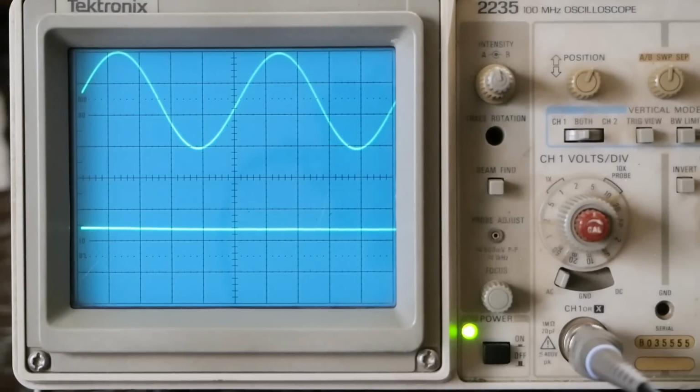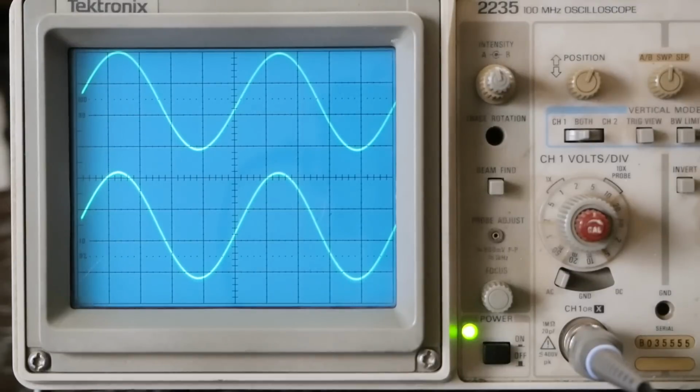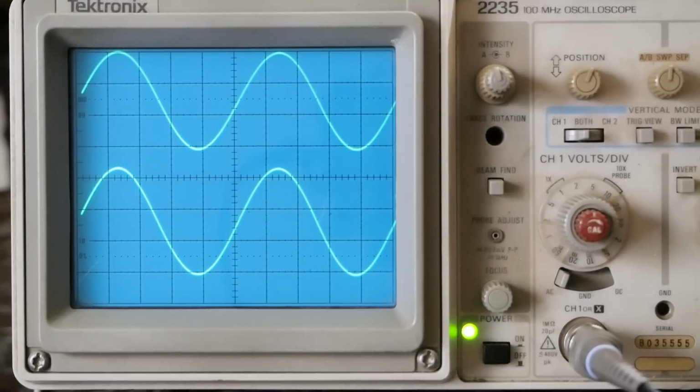So first I want to just see what this sine wave looks like, and this is interesting. There's a little over 3/4 volume, and that's basically unity gain, which honestly, for how most people would use this preamp, that's a good thing. From what I've seen, most people are wanting to use a preamp on solid state gear that probably doesn't really need a preamp, that has enough input sensitivity where the normal signal out of your DAC would just drive it straight out of the DAC. But they're looking for some tube gear to put between a digital source or maybe even a turntable with a solid state phono stage and a solid state amp to add some warmth or tube sound to their system.